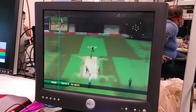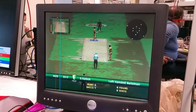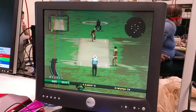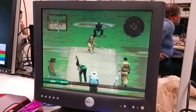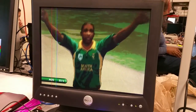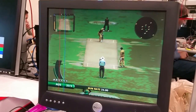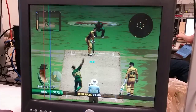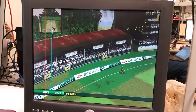First it determines whether the batter is left or right-handed, and then makes an appropriate shot. If you see the red, green, and blue lines, the green is an ideal shot, right in the middle of the timing gauge. The red is where our threshold is set for sending the command, because there is a latency between sending the keyboard press and it being registered by the game. The blue is where the shot actually landed, and that serves as an error correction term. It's just a simple P controller, no I or D terms. And that was out of the park for a 6.